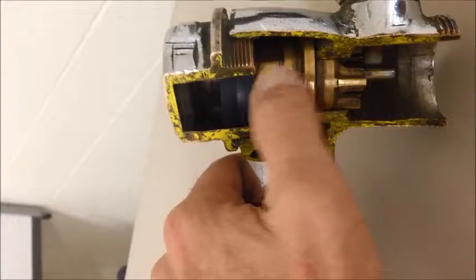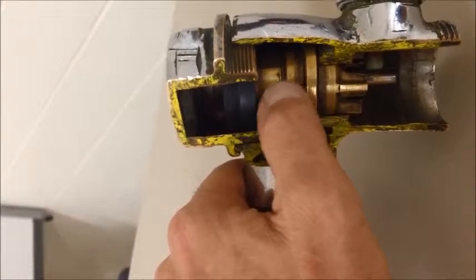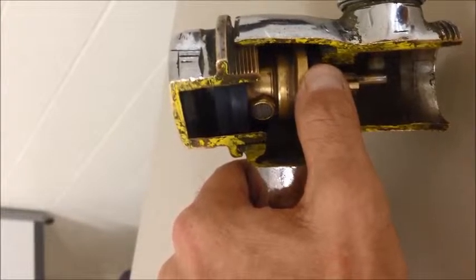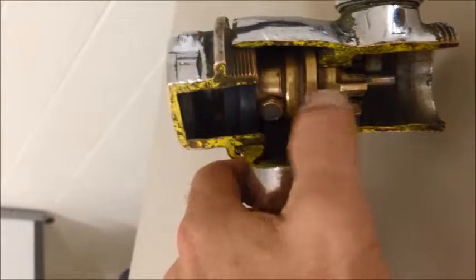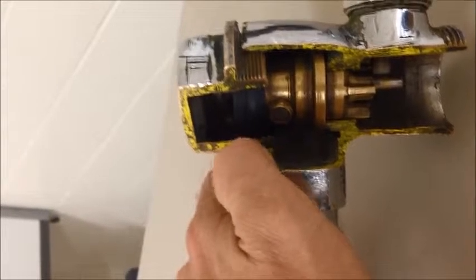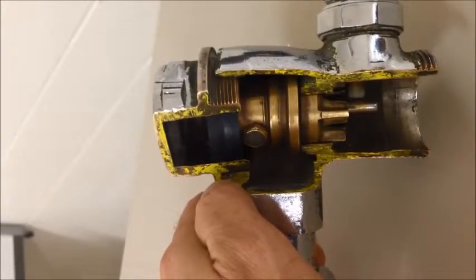It's going through there because now that thing is reseated. With it reseated, all of the extra water pressure is going to the top. And as it's building, it's going to build enough pressure to reseat down here because there is more surface area — not to mention it will be a little bit heavier. So that is your piston type direct flush valve.